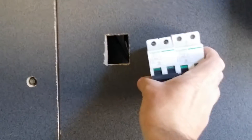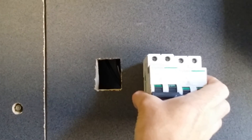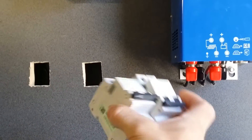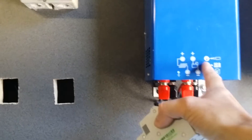One mistake I made was using these DC breakers — 32 amps — but they resisted the amount of power coming from the charge controllers to the battery, so I had to take them out. I mainly wanted them as switches to be able to turn the power off from the charge controllers, but I'll find some other switches to put in instead.